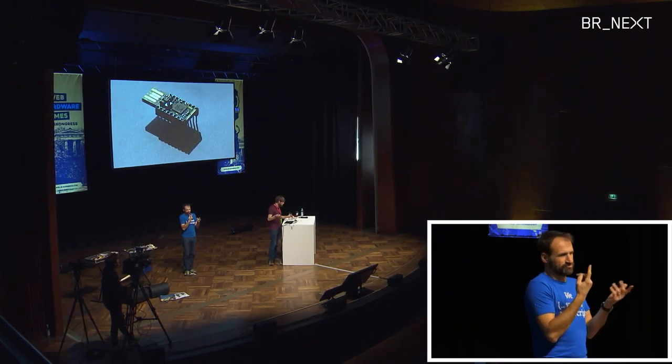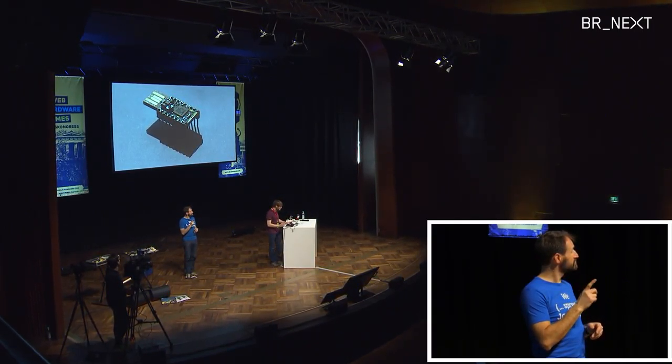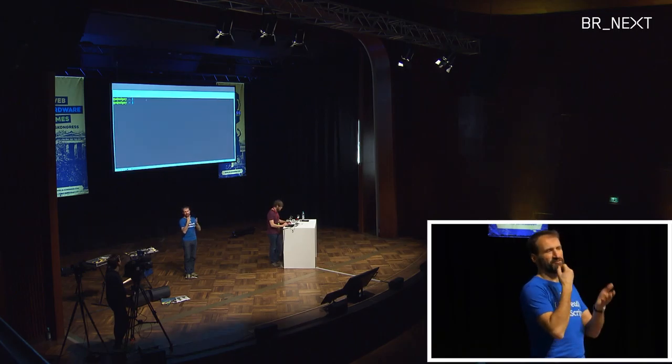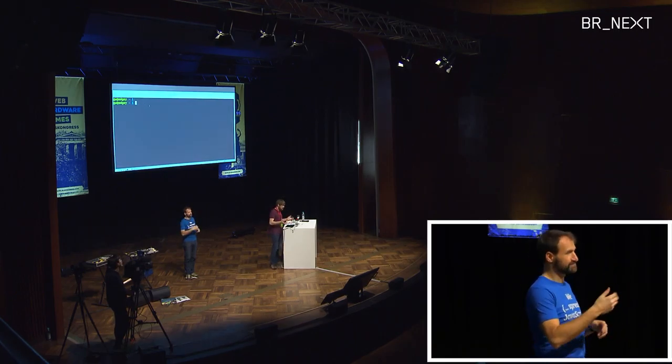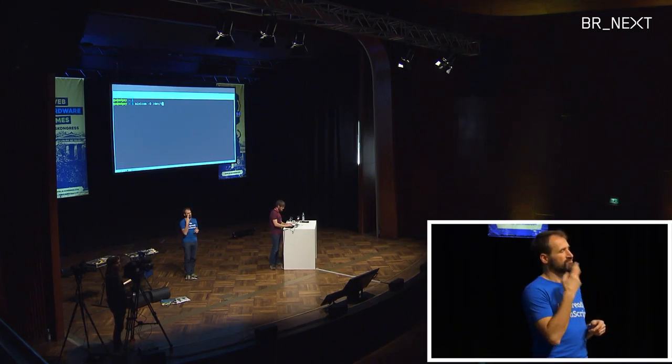Because you're running the JavaScript interpreter, you can effectively segregate the code that you're running and the code that's needed to interface to USB, and you can make sure that USB is always there. So you plug it in, and it should appear as a USB communications port. So if I go to here, with a normal terminal application on pretty much anything, you should be able to /connect.